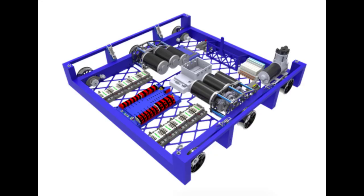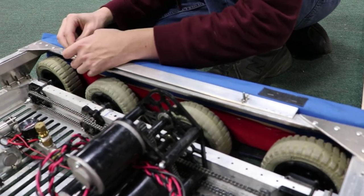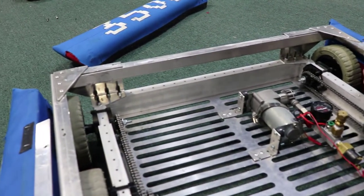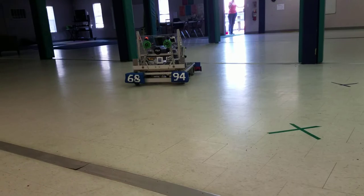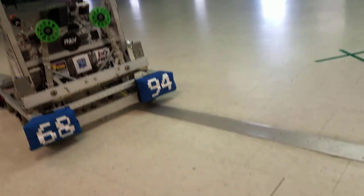If you have a protected wheel well, then the example by Team 254 here will work wonders — mount some 1x1s on top using some riveted gussets, then throw some 1x1 angle on plywood and you're done. We used a similar method in 2018 but with thick sheet metal as our perimeter due to the open wheel well. We had a crash bar on the front and back, and we also put some anti-crush pieces that connected to our tower so the angle didn't get T-boned and buckled in. We also added stiffening gussets on the corners in week two of build. It worked for us, but we need to refine this design more before I recommend it. These brackets weighed about one pound each and worked well — if you have the ability to form these, I would make them a little stronger in the corners and try something similar.